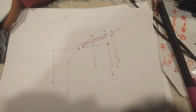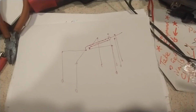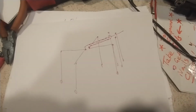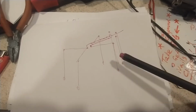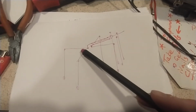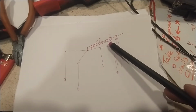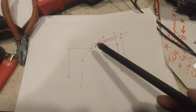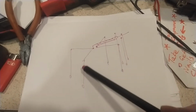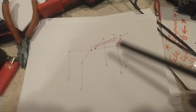So now for a rough-as-guts update on the evolution of this phased vertical array beam for 2 meters or any band. Like the previous videos, the distance between here and here, here and here, here and here, and here and here is a half wave in free space. Element lengths are collectively 3/4 wave each, 4 of them.